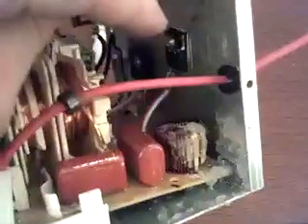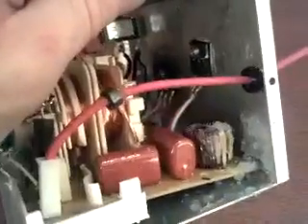The heatsink floats at the collector potential of the IGBT. The collector potential is rectified line voltage at the least, and spikes up to 600 to 1,000 volts while the power supply is operating. That's quite a bit more than most semiconductor insulator pads were intended for. When I first installed this, it arced across the mica insulator pad between the collector and the case — partly because I used Arctic Silver as the thermal transfer medium, which seemed to be non-conductive according to my multimeter, but apparently at 600 to 1,000 volts it is conductive. So use a good electrically insulating thermal paste. This is a ceramic-filled paste, and it seems to work just fine. Just be careful with that and note that it's a potential problem.